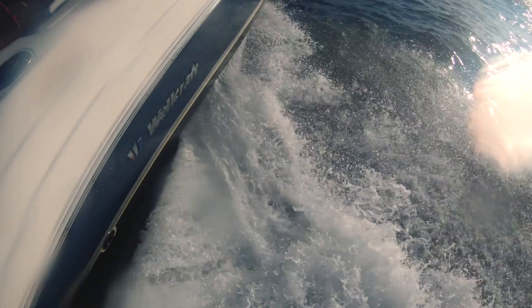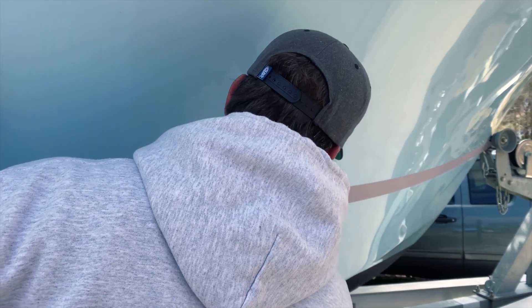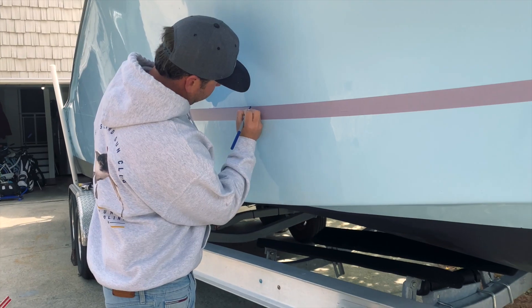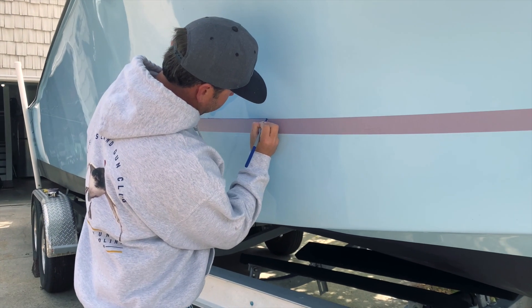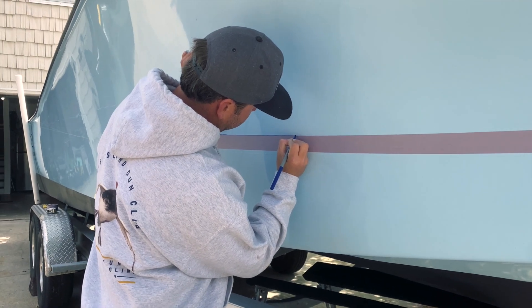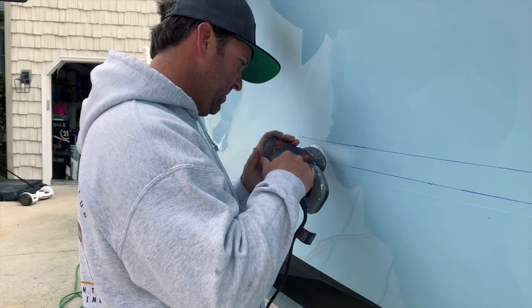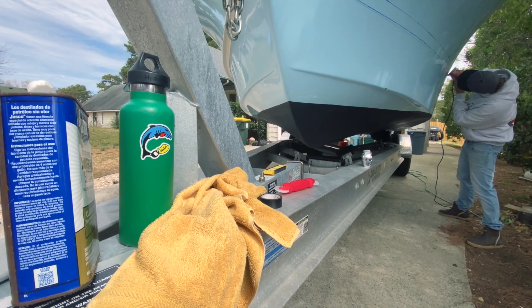The first thing to do is decide where to put them. Get in your boat, go for a ride, look over the side of your bow, and determine where the water is coming up. This is where you want to place your rails, to know where to push down the splash. Dave took care of this before I got there. Dave measured where he wanted to place them, then ran some painter's tape as a mock-up — this is the hardest part. And if a guy with limited spatial reasoning like myself can figure this out, so can you.